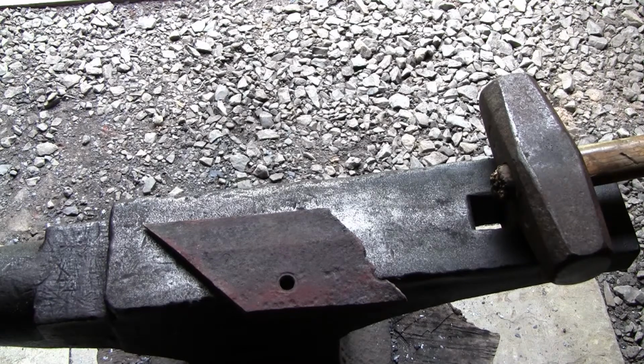And I'm going to be adding blades like this to it more often than not now, because there was a considerable amount of iron there. And steel is more likely to be the metal that's lost in the forge than the iron, so I want to make sure that there's enough steel going along with the iron.